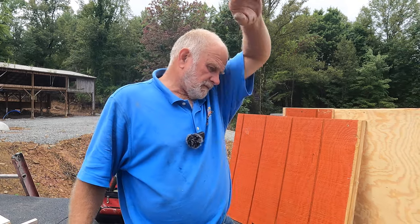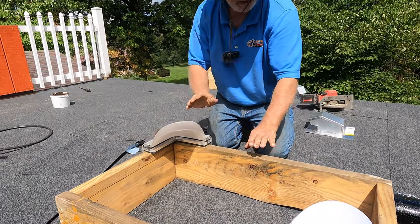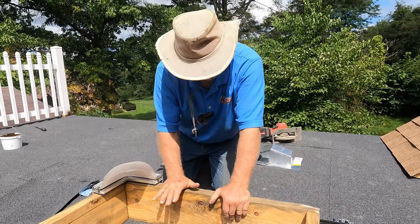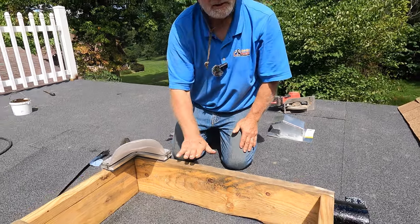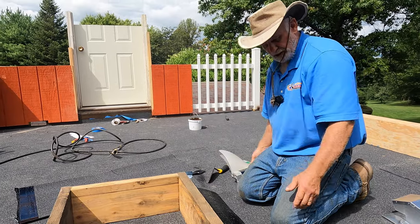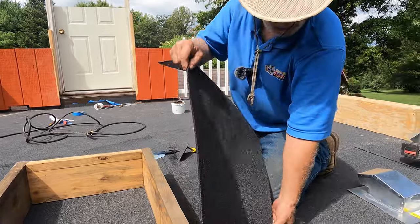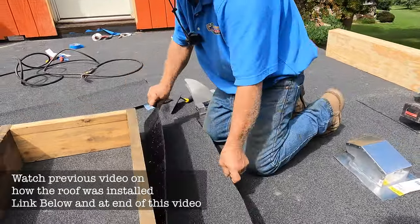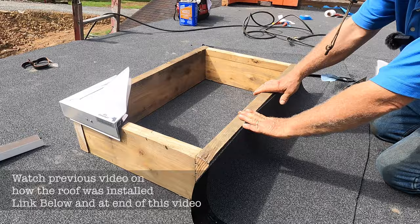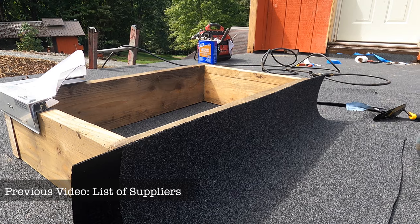Let's go there. This is part of a skylight and it fits over a box like this. It's called the curb. So normally it's just a box like this and the box is 6-8 inches higher than the roof. Okay, so I'm going to show you how to do the flashing around this curb or the box. So you take the same material of the roof that you have and you bring it right up like this. Right there to the top there, see? Just like that.